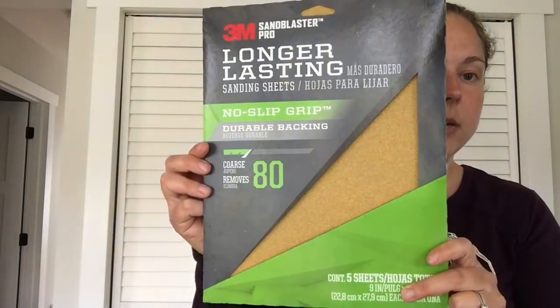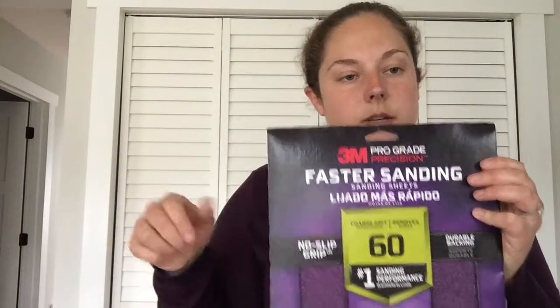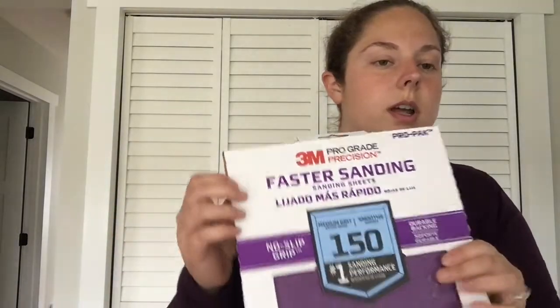So I'll show you the products that I ended up using. I used 80 and 60 grit sandpaper. Here's the 80 sandpaper that was used. And then here was the 60 that we used mainly on the square coffee table, because underneath it, someone — a previous owner — had painted it black and then painted it white. So there were a lot of layers we had to go through, so we ended up using the 60 on it. It just made it a lot faster. And then to smooth things out a little more, we used the 150, which got rid of any roughness that the 80 and 60 would have left behind.